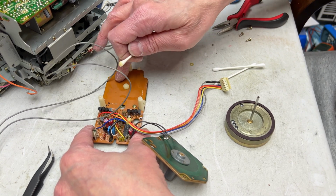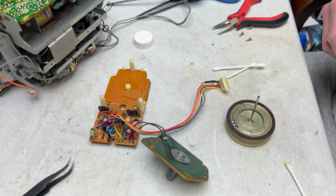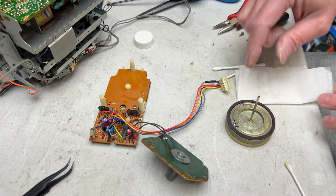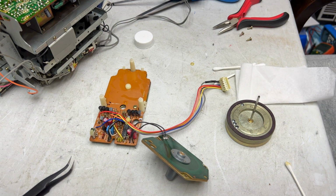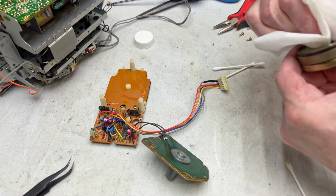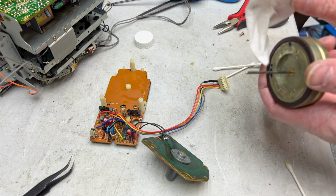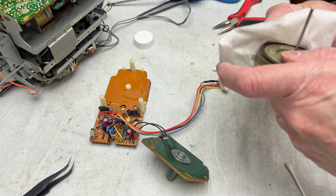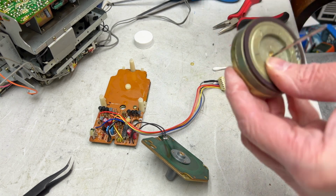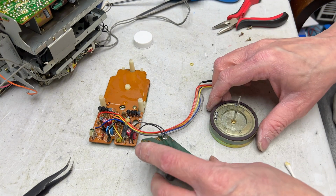And obviously nothing on the circuit board that can interfere, like wires. Okay, I'll just grab my Kimwipe again that I was just using, and we'll clean the capstan again with acetone. Squeaky clean, that's the way we want it. And I don't really have to do this because there's no belt to go on top of this flywheel, but I'll give it a once over anyway around the outside, because you don't want anything throwing off the balance too much either.